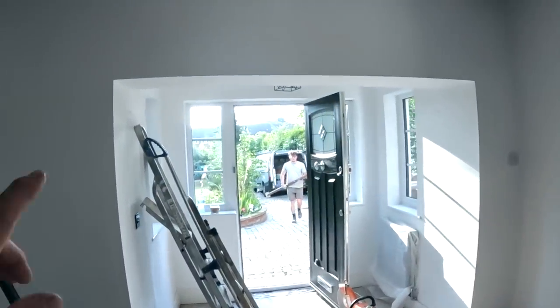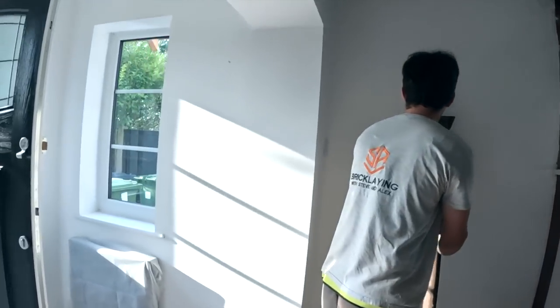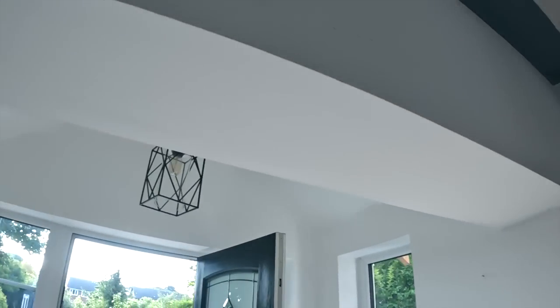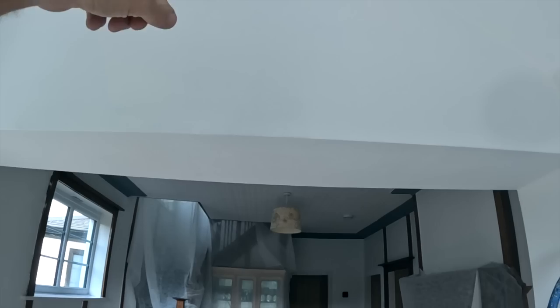What's happening is this, where this beam is, this is the old front of the house. This porch has been added on. Front door used to be there where Alex is. And apparently customer says there's a beam here, a wooden beam with a brick arch over it. And when the porch was built, they put steel in here, or whatever, a concrete beam, I don't know what it is yet, to be leveled, but this was put up higher, so this has been boxed in level. So what we're doing is taking this wooden beam out,